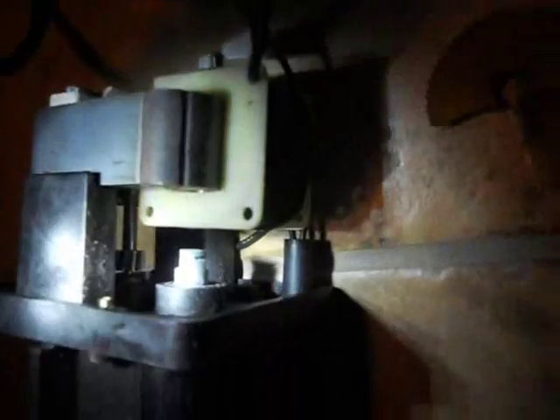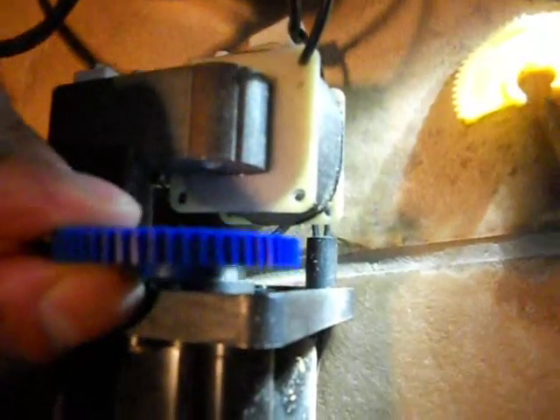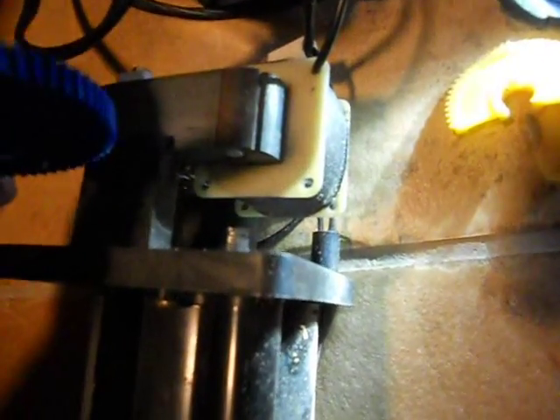In case you're wondering how the gear goes — there's actually a flat on the very end of the shaft on the motor. The gear has a flat as well, and it's in the back of the gear. So the gear goes this way when looking at it — it's going to go like this, not like that. Make sure it's on correctly. I remembered by seeing a witness mark on the old gear.